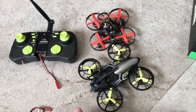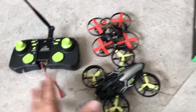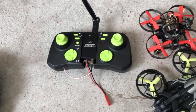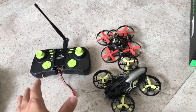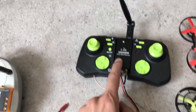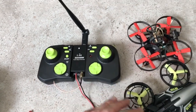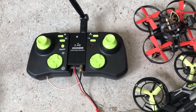The other problem with this drone is that the controller doesn't have enough range. As you know, this is a toy drone, less than 40 USD — really cheap. The control range is really line-of-sight, up to 30 meters. If you're going to fly from one room to another in your house you're going to have problems reaching the furthest corner. So here I've installed a 2-watt booster — this is a WiFi booster but it works for this controller. I'll post a few pictures to show you how I wired it up. It's not really difficult, just needs some basic soldering skills.